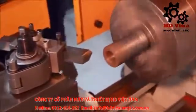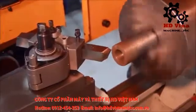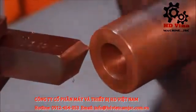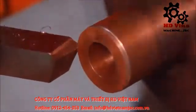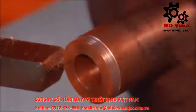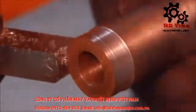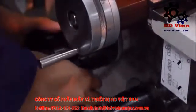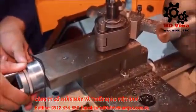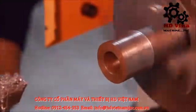I'm turning on the lathe machine now. First I will be touching the tool with the workpiece to mark my zero on the dial. You can see how the chips are flying — it's a good thing I've kept my glass window on my side; it prevents the chips from reaching my hands. The spindle can also be used to turn the workpiece — you can notice that the spindle moves very slowly. Now that we have turned our workpiece, this is the result.